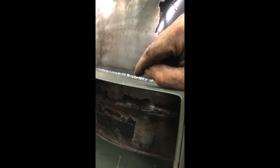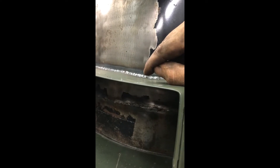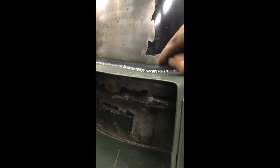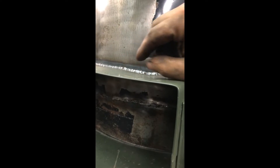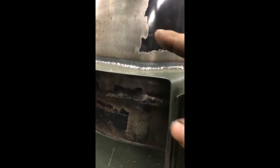This is what I call stitch welding. I get a tack set and I start on the leading edge of the tack and give it just enough heat until I watch the puddle fall back on top of my tack. Then I move forward, let the puddle fall back, move forward, let the puddle fall back. That's how you fill a very small gap in super tight sheet metal like this. When you do that — see those little tiny minor inclusions right there? That's where the wire stopped feeding when I let off the trigger on the MIG gun.